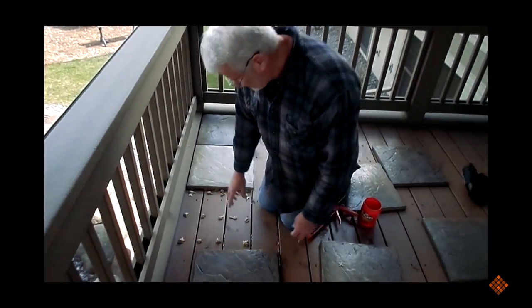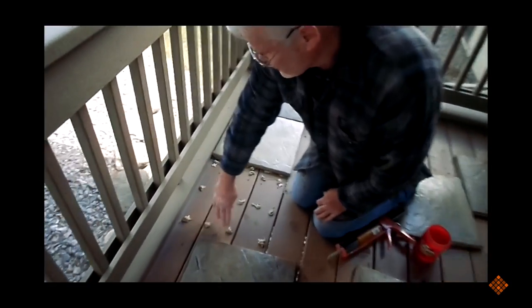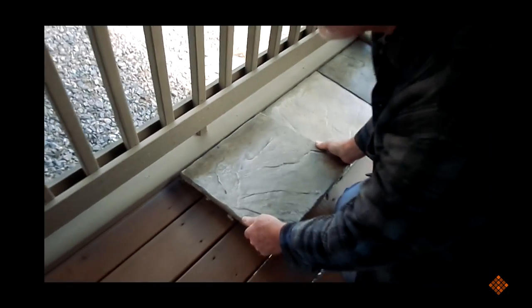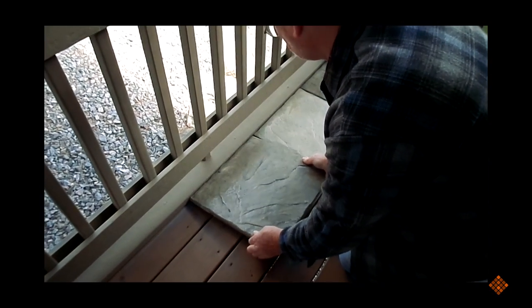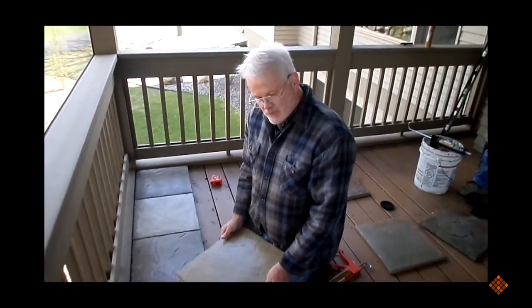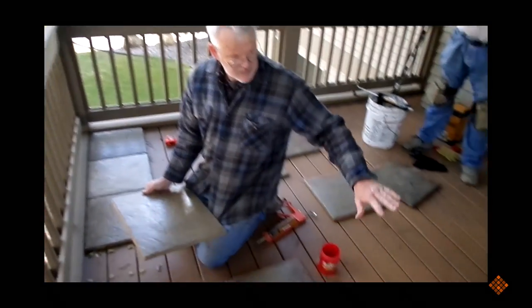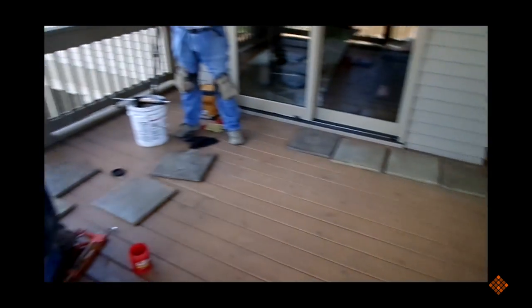Once you get your glue in place, we have little marks showing where the edge of the tile comes so we knew where to put the glue — it ends up right on the edge of the tile. Then you just put it in, drop it, and make sure we have our chalk line back here to adjust it. Also notice that we have tiles here that are slightly off color. We have tiles spread out so that we can pick and choose colors and make sure we vary them as we're setting.